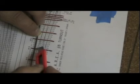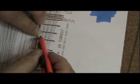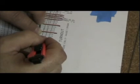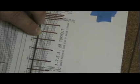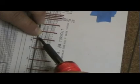Anyway, what you're going to do is, you're not going to solder here. You're not going to put solder on the inside here, because you don't want that interfering with the point resting against the stock rail. So you're going to sight along the line on the template, the base of the rail, where you actually have a good rail base where you haven't filed it away. I'm going to take another little disc, put it right there, again partly on the base, partly on the tie, and just touch it real quick. There.